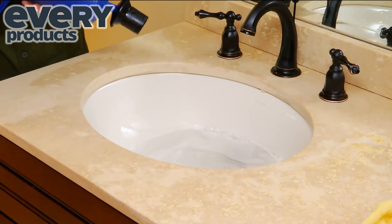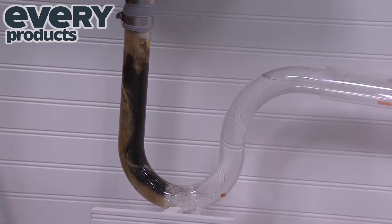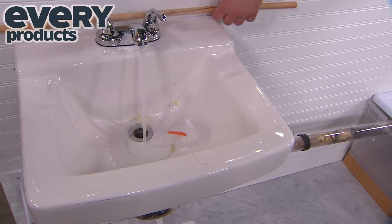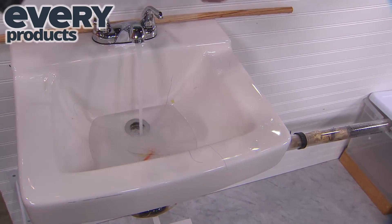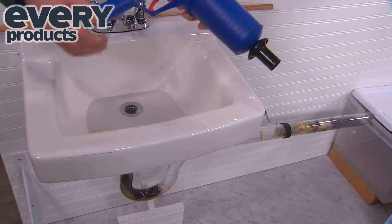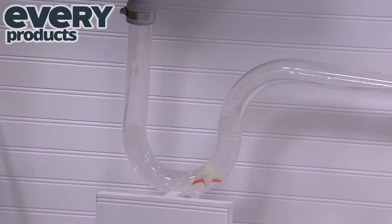Do you see what I'm putting down the drain here? I'm literally clogging my drains. Typically you're not gonna do this at home — I'm using a stick, I'm jamming down paper towels, we've got a banana peel. Say you have kids — little Timmy takes his sock and maybe drops the sock down in there. It's just air pressure. We're gonna go ahead and jam that down. This is far more than what real life usually does. Remember, you cannot compress water, so water's gonna push the clog out. It doesn't matter if the clog is ten feet down your lines or just a foot down. As your lines leave your house they get bigger, so the clog will eventually work its way out. If it doesn't work the first time, simply pump it up and use it again. I've pumped it up about eight times — that's about eight pounds of pressure. I've got the one-inch nozzle. Don't blink, because you'll miss it. Ready? I'm gonna instantly clear my drains safely. Three, two, one. That's it. Air pressure. I love it.